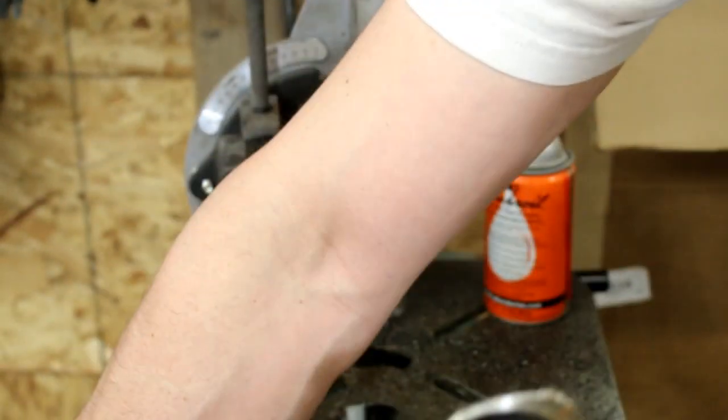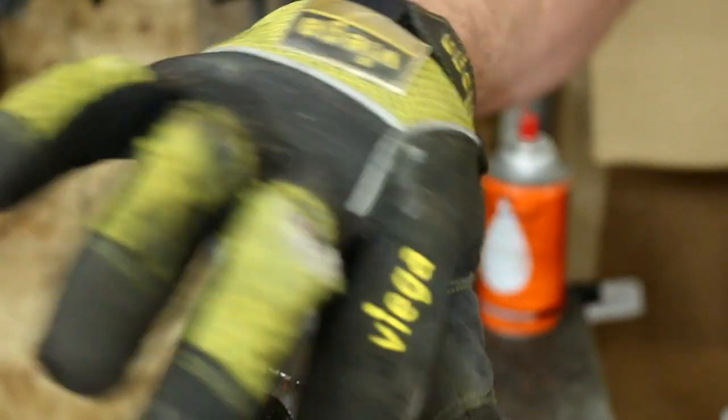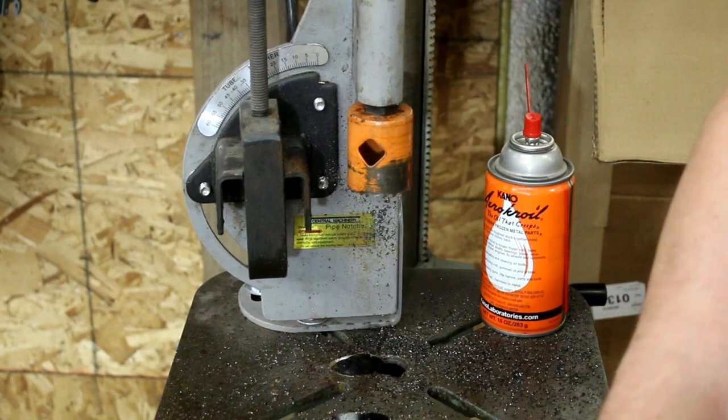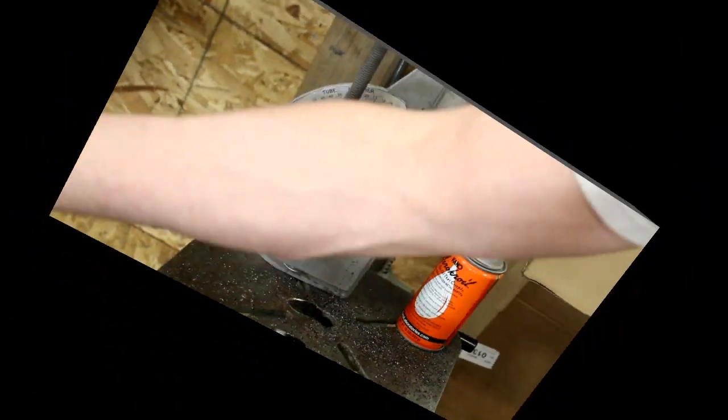So what I'll do is take my little grinding wheel, the flapper disc, and I'm going to bevel this backside, clean this, round these off, flatten these up a little bit, just to give me a better edge to weld to and get a lot of that slag out of there, but that's how quick it is.